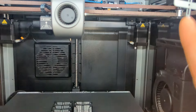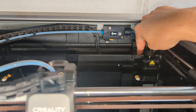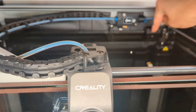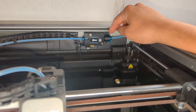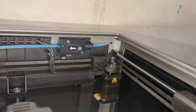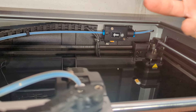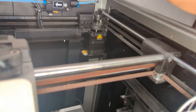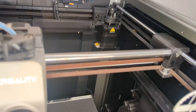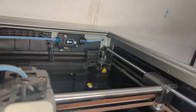Mine are pretty much alright. The way it works is that you'll unscrew these two bolts right there — those little screws. That would release the tension on this right here. Now, on your K1s, in your little bag of extra screws, you get two extra screws that you can put right there, and you can put the other one right in there too. If you tighten them down, it's going to cause your belts to loosen. And if you untighten them, it'll engage the spring and pull the belts back to tighten them.